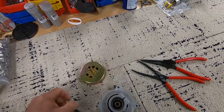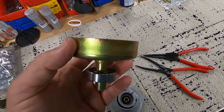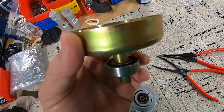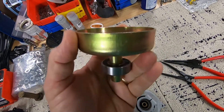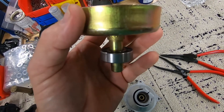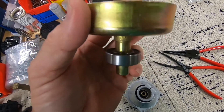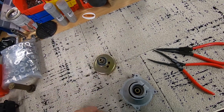That's the culprit. So if you have a machine that has a locked drive system, it is not your gearbox — it is simply that bearing locking the clutch housing. If that doesn't spin, your gearbox is not going to spin. I've never seen a gearbox lock because those are full of gear. Even if you put water in a gearbox, it's not going to lock it. It's this roller bearing here that locks. Simple fix.